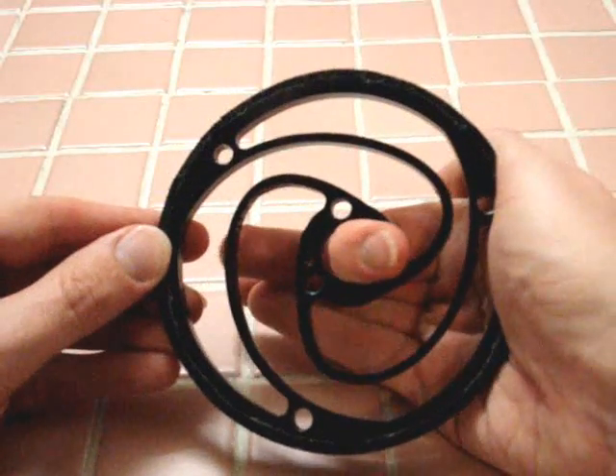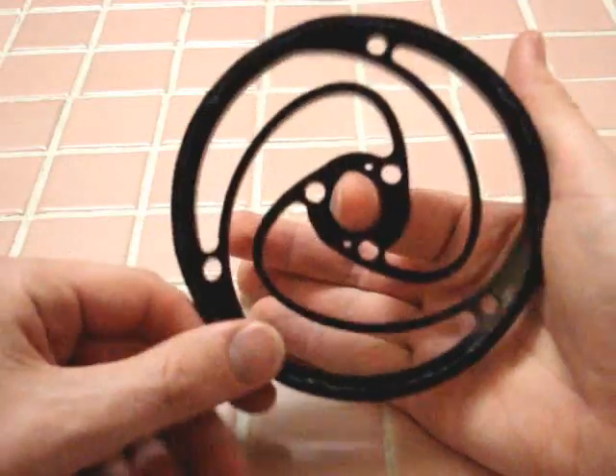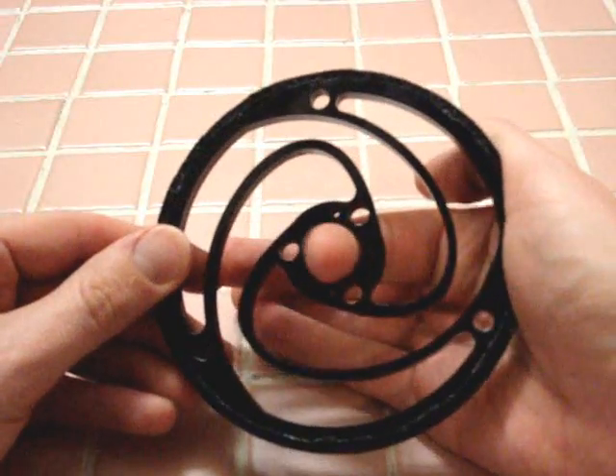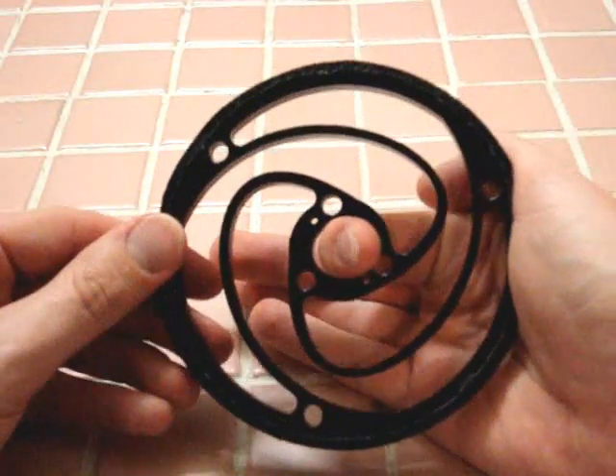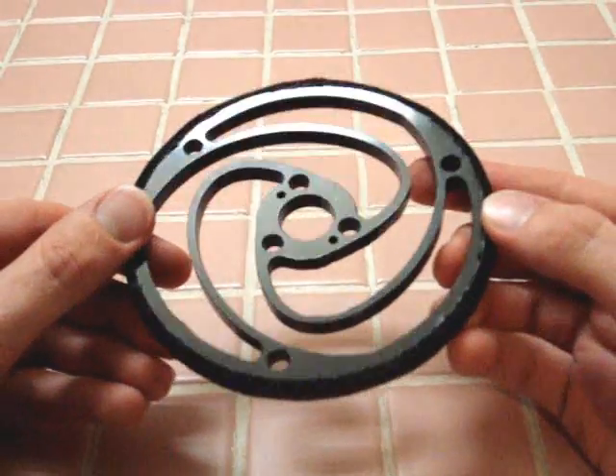The material used was Delrin. Here I am bending it at various angles to validate the FEA. This particular wheel design was made more stiff than it should be due to manufacturing considerations, but it was sufficient to protect the robot from higher frequency vibrations.